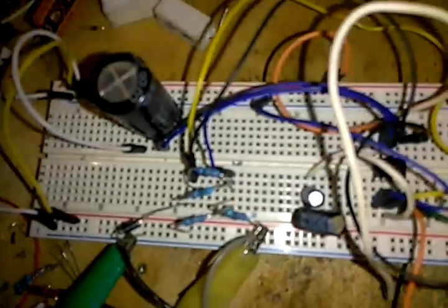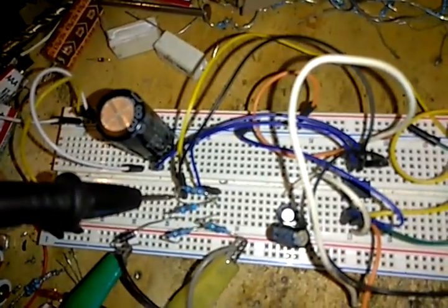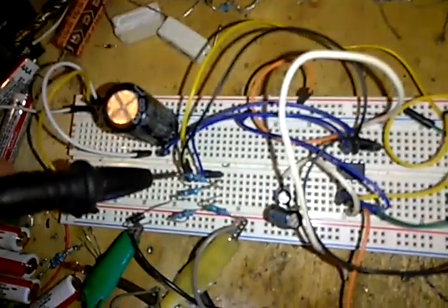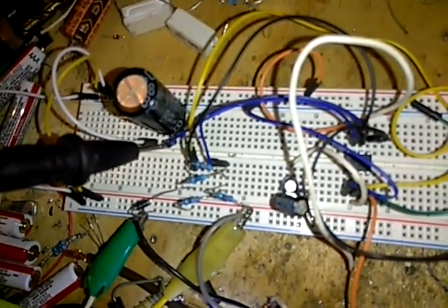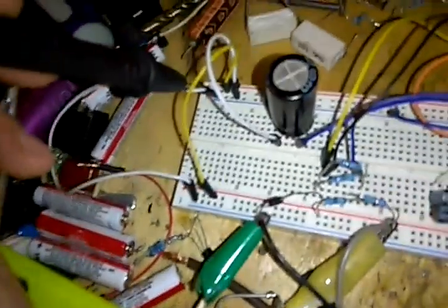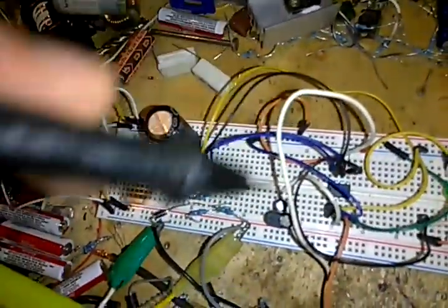And if you'll notice, let me use this side right here, that has the 2,000 ohms on it, and the diode that runs back to the negative. My input, this right here, goes to pin 6. Now, pin 6 also goes to the positive side of this capacitor, and then the negative side of the capacitor, of course, goes to the negative side of my rail. I've got my jumper wires here from positive to negative. This isn't part of the circuit, that's just keeping my positive and negative on both sides of the board, so I can jump onto it at any time.